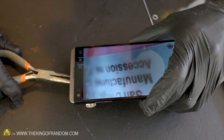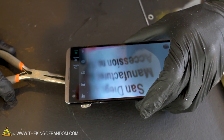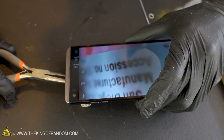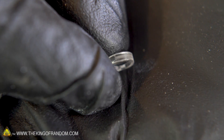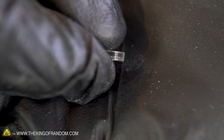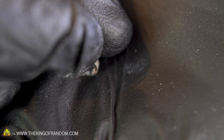You should now have a hole that your lens can fit into, but before you attach it permanently you need to verify that you're going to have it facing the correct direction. Both directions will give you some magnification, but if you have your camera pointed in the wrong side you'll have a very narrow area that's in focus. More of the screen should be in focus if the camera is looking in the correct direction. These lenses have two sides to them — one side is completely flat and the other has a small ring going around a domed surface.